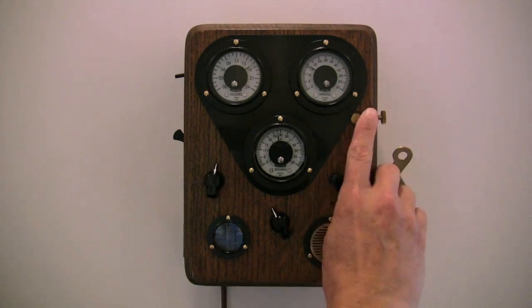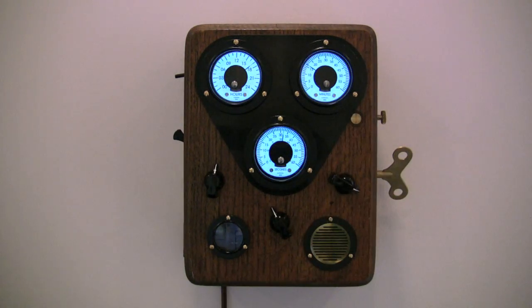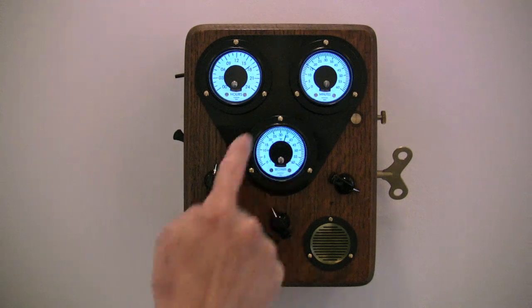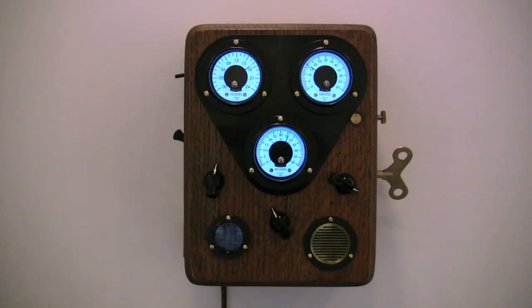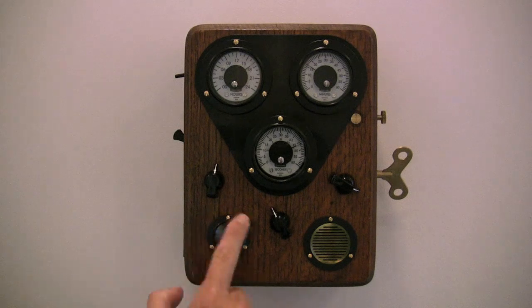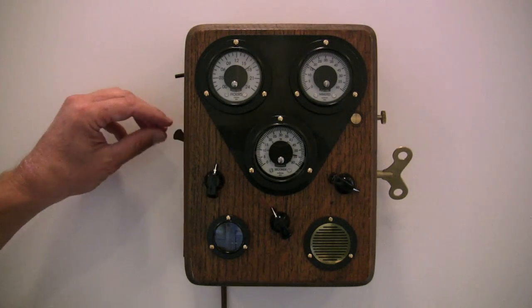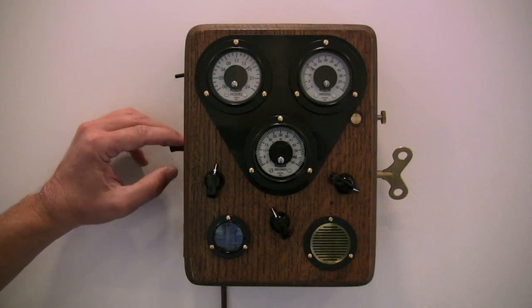I use a capacitive touch sensor for this. The dimming, and then the gauge faces themselves, are actually made from a piece of electroluminescent plastic film, which I've printed with the seconds and dial markings and stuff. The screen for the moon phase video is an OLED screen from a company called 4D Systems. The switch on the side is a 5-way guitar switch.